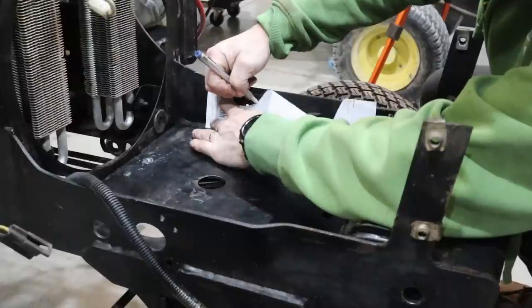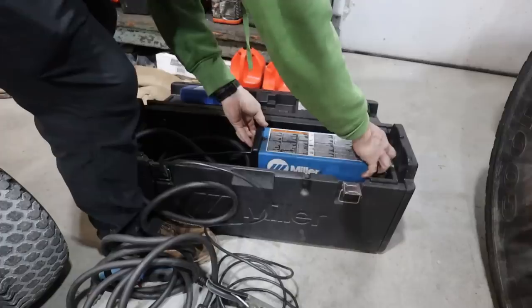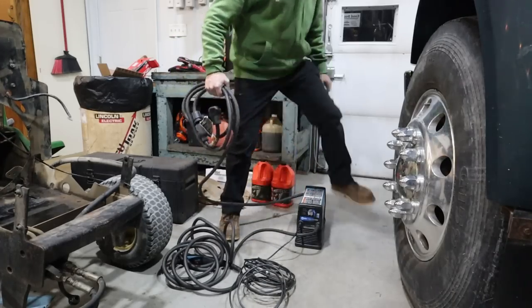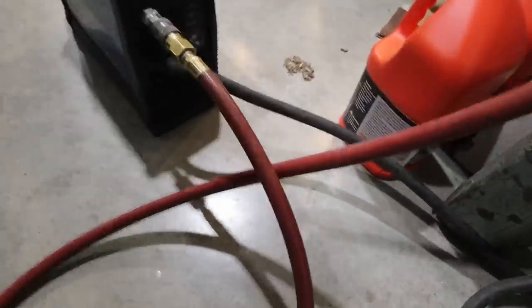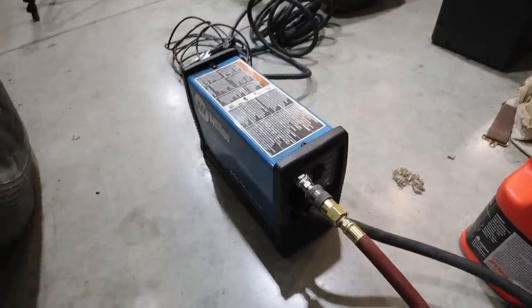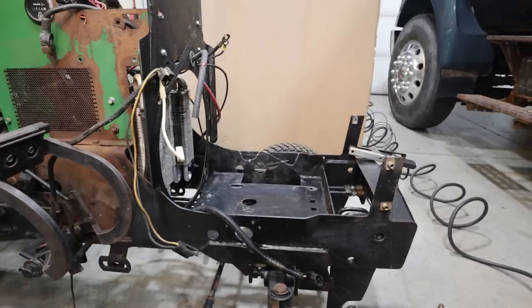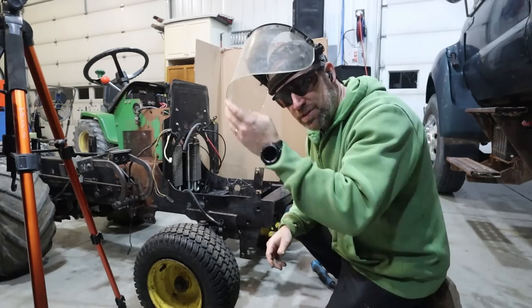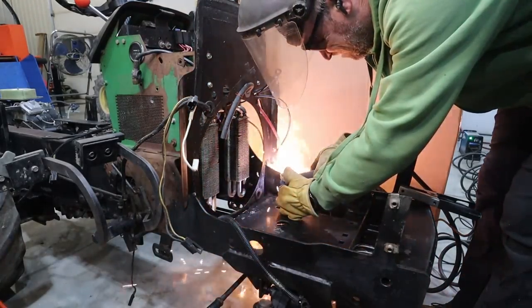We are going to get this marked out and get it cut. I have a plasma cutter — I don't think it's made an appearance on this channel yet, so this is a first. Plasma cutter hooks up to 220 volts just like a welder. You also need to connect an airline because it uses air to blow the material out. You have to ground it. Plasma cutter isn't as bright as a welder — I use a pair of tinted sunglasses and a face shield to help keep sparks off my face, plus gloves. It doesn't produce near the heat or light that a welder would — it's kind of more like a blow torch.